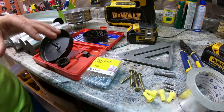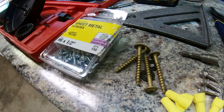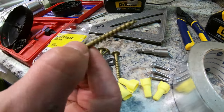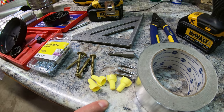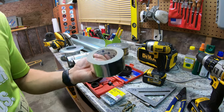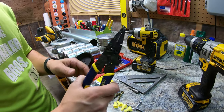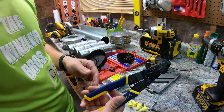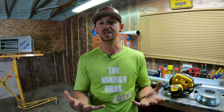A speed square for marking backing. We need sheet metal screws to screw all of the ventilation together, and screws for mounting it to the ceiling. We need some wire nuts for connecting the power, aluminum foil tape to tape everything up so it's nice and airtight, and a wire stripper to strip our wires for the electrical work. If I went over the tools and materials too fast, I'll leave a list in the description of all the tools and materials we used to complete this project.